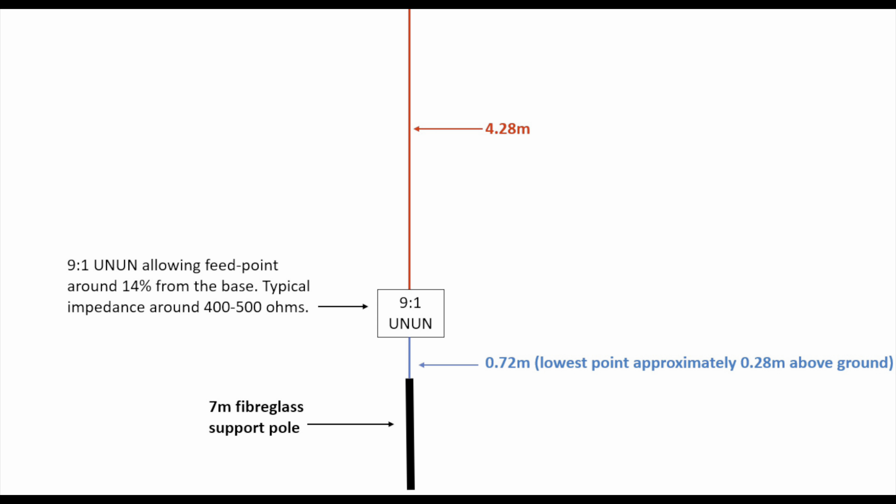Here's a drawing of the proposed antenna. I've taken the traditional half-wave formula of 143 divided by the frequency in metres, which gives just over 5 metres - 5 metres 1 centimetre - for 10 metres at 28.5 MHz, about 16 feet. Feeding about 14% or 15% from the base means we've got a much taller top length and a much shorter bottom leg. I'll attach the top leg to the hot radiator side of the un-un, and the bottom leg to the ground leg. We're basically producing an off-centre-fed vertical dipole, and we're going to see whether we can get a match on 10 metres.